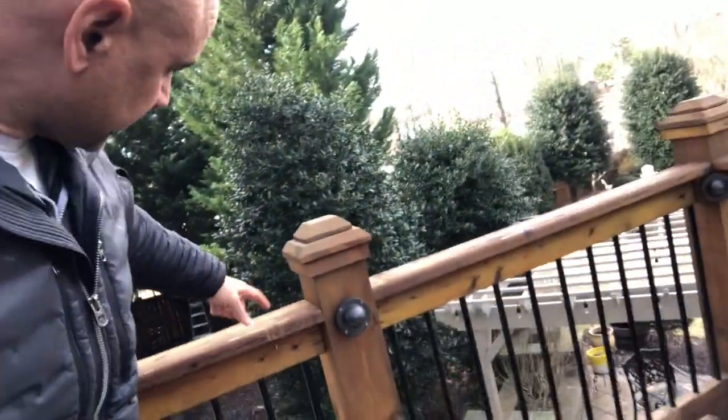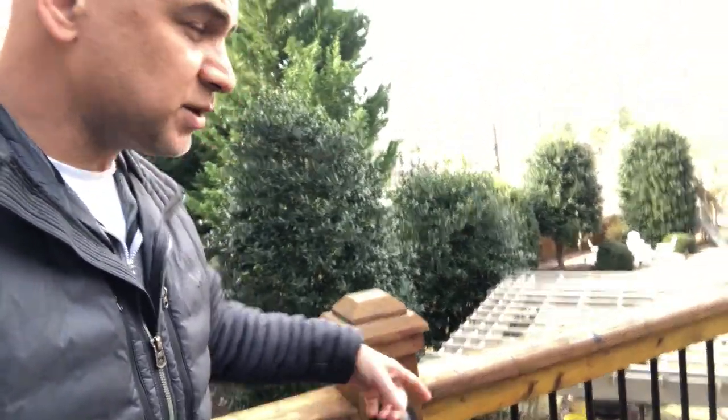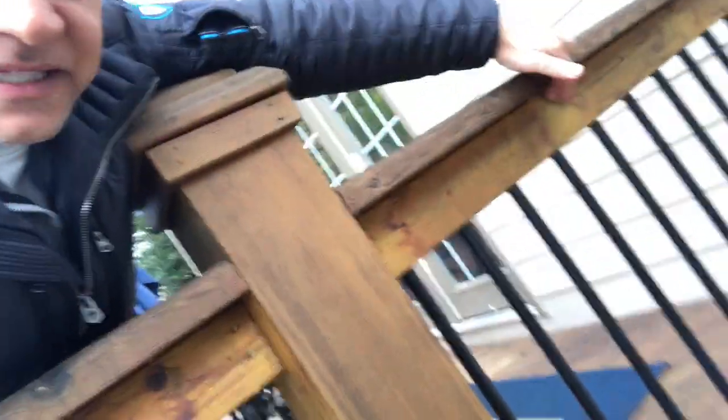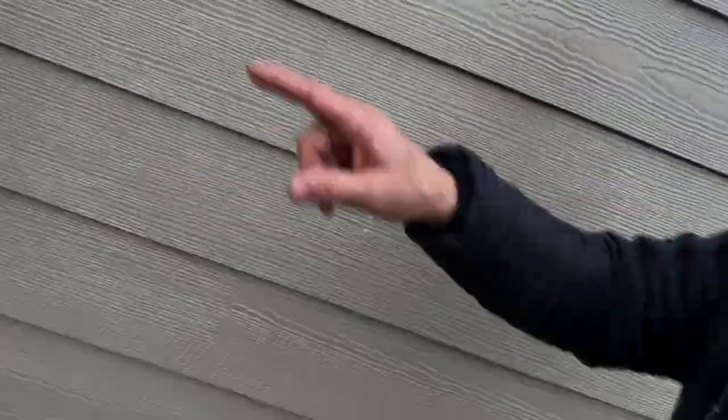You'll notice here's one of the wires coming right down the side of this deck area. We've got it tucked away really nicely. At the house you're going to have to tuck this wire in at a couple of different places — you want to do it in the most concealed, inconspicuous area possible, because the rest of the installation is so clean. The wire routes up right underneath this two-by-six into the post, and where the wires come out front they can be connected and tucked back into the post. I've seen lighting jobs where wires run up the outside of the post, dangling out — the job is not clean. We want to keep these wires as hidden as absolutely possible, and in this particular deck there are only two visible wire locations.